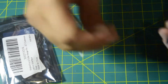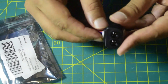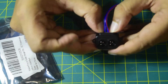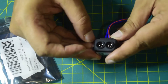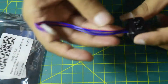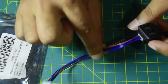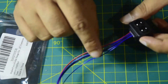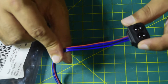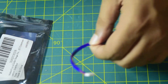To repeat the connection: 5V, RX, TX, and ground. Let's connect the JST connector here. Ensure that whenever you connect to the JST you do it in the right direction, otherwise you will damage the pins inside the connector. On the other side of the long wire there is another JST connector which we will not be needing, so let's cut it so we have enough wire to solder onto the flight controller.